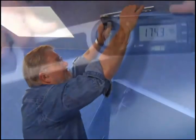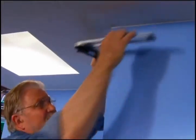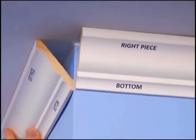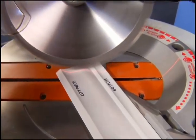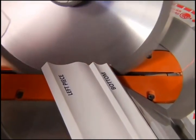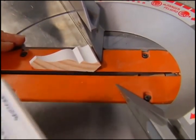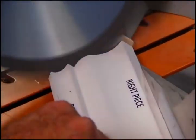Here's how to handle an outside corner. Use the digital protractor to measure the wall angle and calculate the miter and bevel angles. I've marked the molding for orientation. When cutting the left hand section of an outside corner, swing the saw arm left and place the work to the right side of the blade with the bottom edge against the fence. For the right hand piece, swing the arm to the right and set the work to the right side of the blade, but position the bottom edge away from the fence.